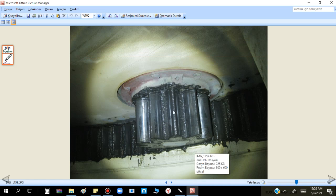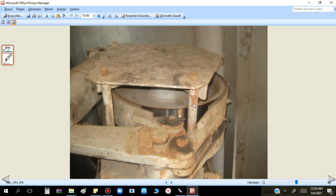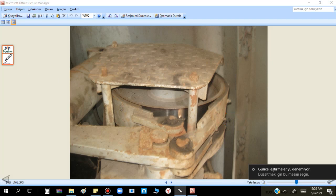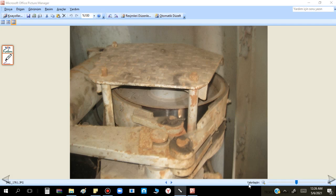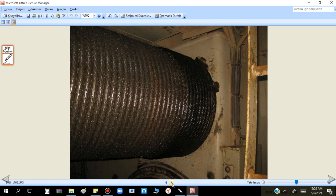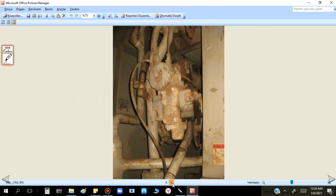This one is turning this one to make the crane swing. They put some metal pieces here like a matchbox. When this brake lining falls down it starts to contact with this one, and when open, when closed, it makes voices. This is a typical problem. Now the luffing drum, this is the hoisting drum, this is the hydraulic mechanism.